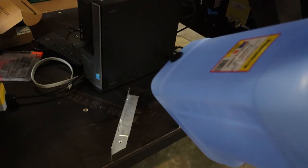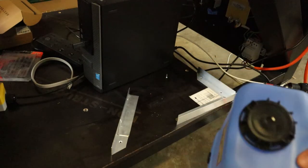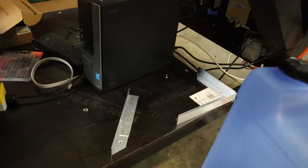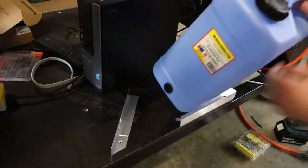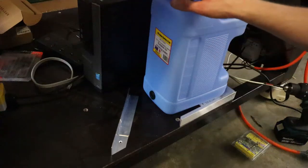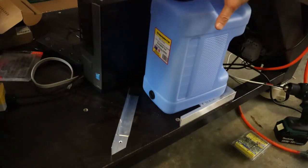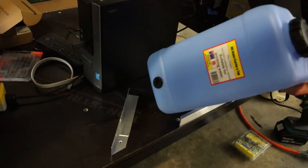For my water cooling reservoir, I found the best solution is a 10-litre water can from a camping shop. They're pretty cheap, and they've got a nice big wide mouth so you can get a pump, lines, and bits and pieces in there. The problem is there are no tabs or mounting points on them. So I'm going to make a couple of aluminum brackets, bolt them down on the side here. The reservoir will go over like that, and then I'll have a strap that comes through the top to hold it in place and keep it nice and secure, with easy access between the radiator and the mouth of the reservoir. That's also where I'll have the pump. An alternate option is to open up this line here and have a pump sticking out that feeds it up and returns in here. Either way, plenty of options — nice and cheap, and too easy.